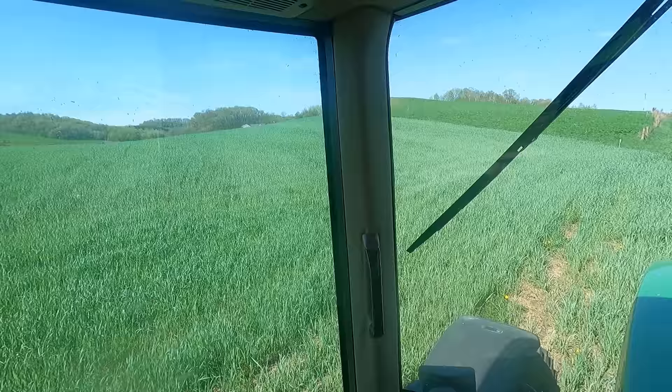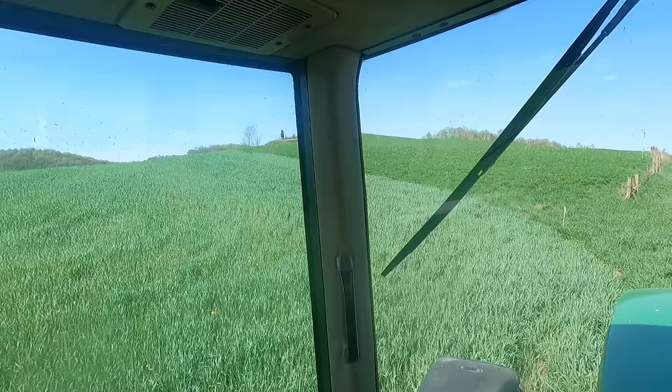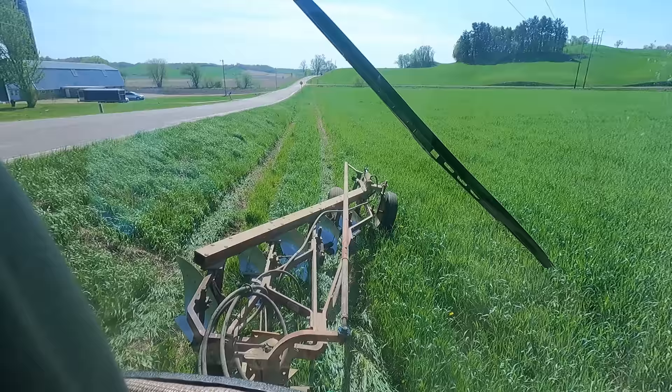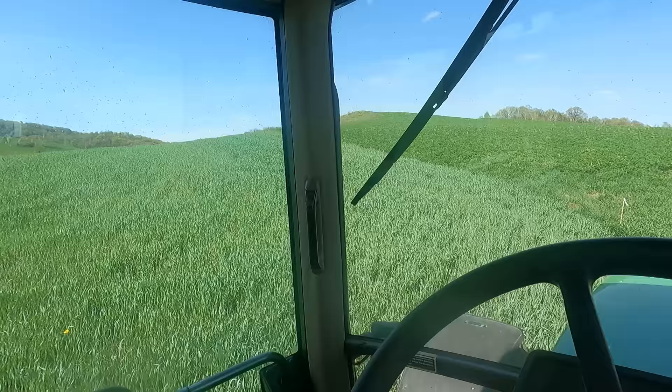I wanted a rollover plow, but they're not very popular around here — they're virtually impossible to find used. I did try to price a new one but the guy never got back to me. There's also what they call a reversible plow, which I think uses some sort of hydraulic system that just slips the plow to the other side, so instead of plowing to the right you're throwing it to the left, instead of turning the whole machine upside down. It's a lighter machine so you don't need as big a tractor. Right now we've got a 115-horse four-wheel drive — more than enough — but if we had a rollover plow I think we'd need a bigger tractor, especially on the hillsides just to handle the weight itself.